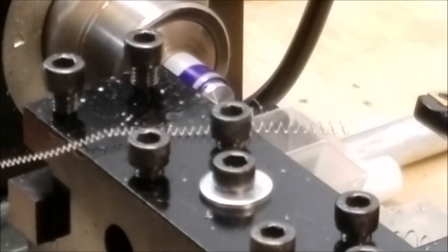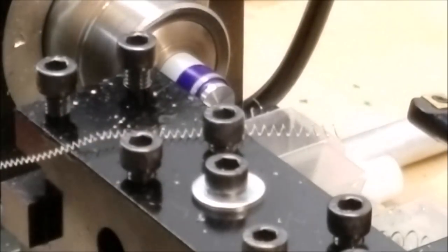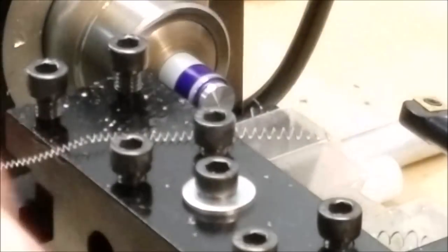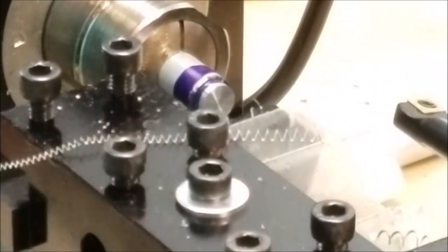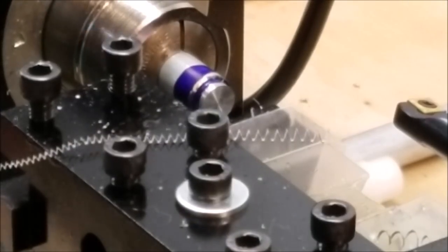We just took our face cut. I'm jogging the tool off of the part — jogging it in X but I am not going to move it in Z. I'm keeping Z right where it's at. So now we have established the Z zero point. Step three says: take a skim cut, keep the tool at this Z position, use the X axis to clear the part but do not move the Z axis. Stop the spindle. We've done all that — on to the next step.